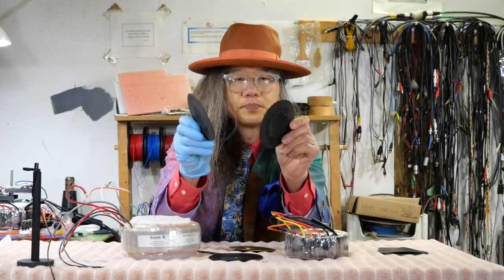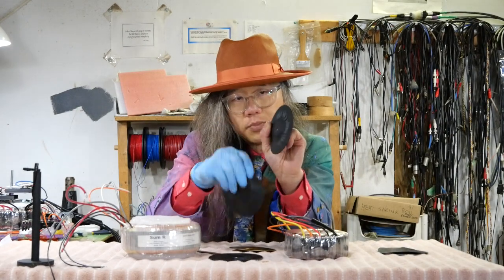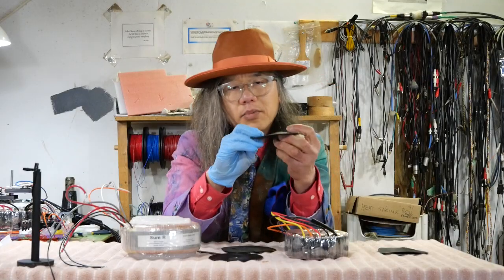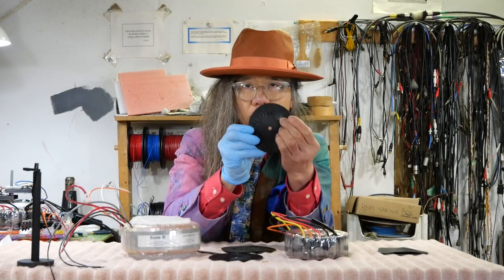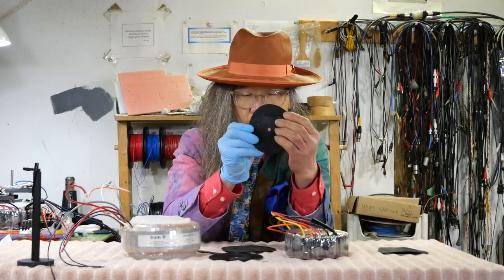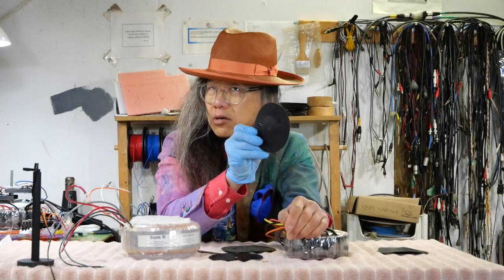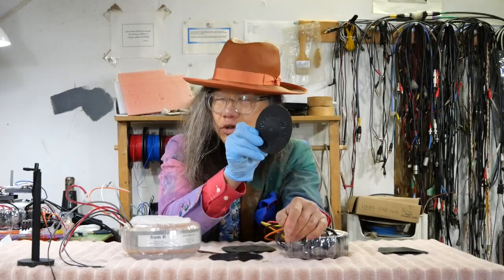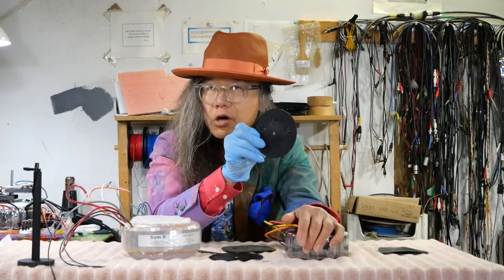In my experience, that's exactly what happened. I have some older ones here — see all those dimples? Those marks are wire marks. This is about 10 years old. Those are the marks where the wire pressed right against the transformer. The transformer is still working and things seem okay because it's not moving, but for how long?